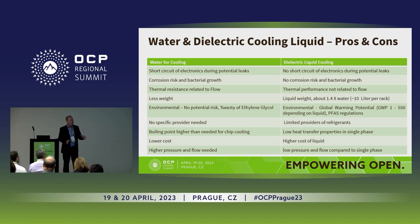One important thing to understand with dielectric liquids — and this is probably the reason we had to develop this evaporator cold plate — is that dielectric liquids not only do not conduct electricity, they do not conduct heat. You cannot use them like a standard cold plate where cold liquid comes in, heats up, and takes heat out, because they are very poor at carrying heat. That is the reason that to be useful in a data center or server, you need to change phase and take the heat with the phase change. This is what dielectric cold plates are about, and that's why they're called two-phase — not because two-phase is the important thing, but because it's a must.